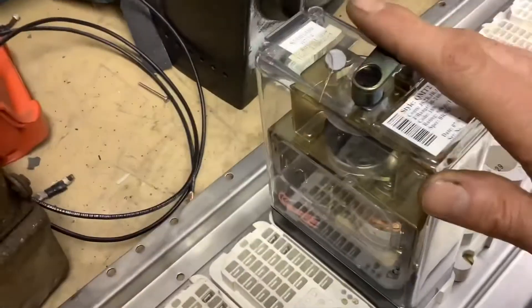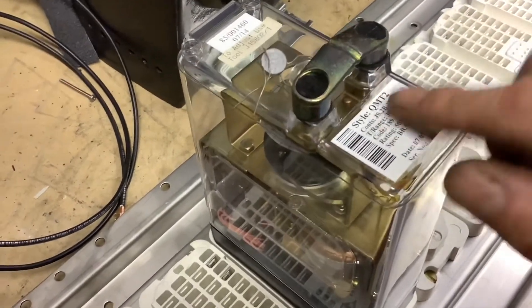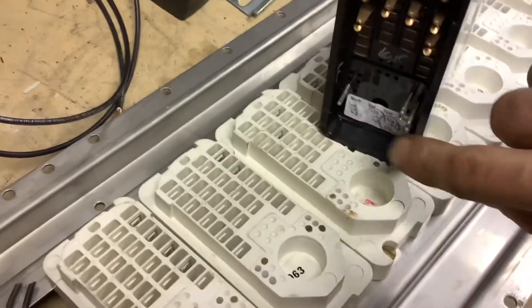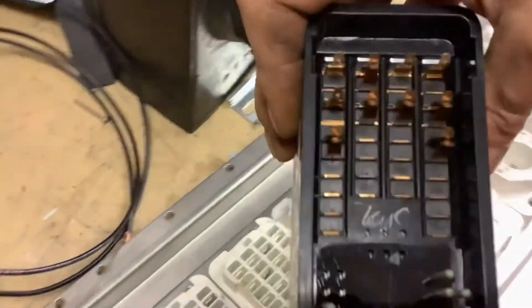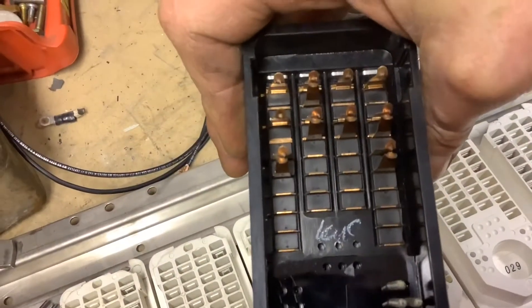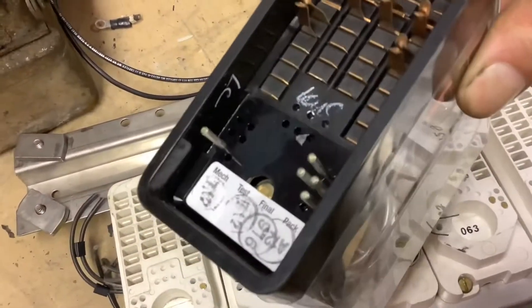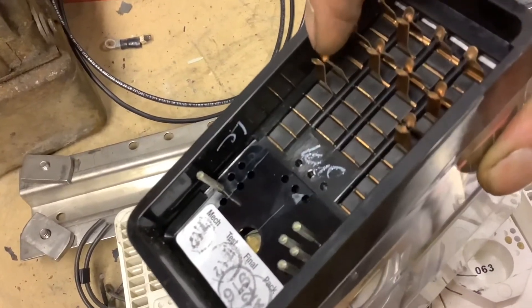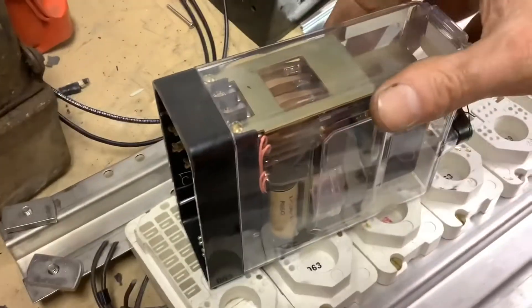For demonstration, I've fitted pin code 189 — which is a motor timer relay QMT — into the base, and you can see it sits down quite snug. Taking it out and turning it round, you'll notice the pins on the base that effectively act as the pin code. One thing to note with heritage relays: look carefully to make sure the contacts haven't been bent too wide open — you want them nice and tight together, without big gaps appearing around the contacts.